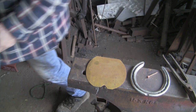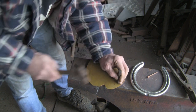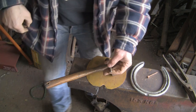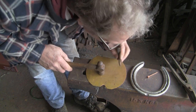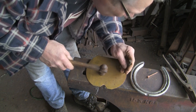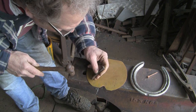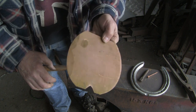If I can find my centre punch — just needs a light tap. Oh, I've lost the end off my punch. Just grind it up — put an end back on it. This punch is hopeless. I think it was originally for woodwork and it's as soft as anything. I've tried hardening it up and I think that was the result — I hardened it and just chipped the end off it. I hope to make myself a decent one out of some spring steel I've got somewhere. There we go, all nice and punched.